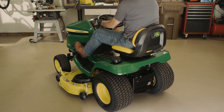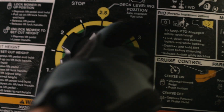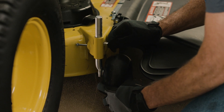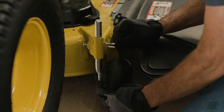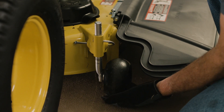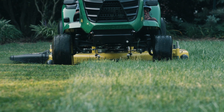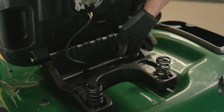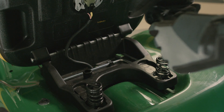Fully raise the mower, adjust the cutting height knob to the desired cutting height, and lower the mower. Adjust mower wheels to the lowest position where they are at least one quarter inch off the ground. The wheels carry the mower deck over any higher areas in the lawn to give it a smooth even cut, and return the deck gauge and mower deck leveling wrench to their storage position under the seat.